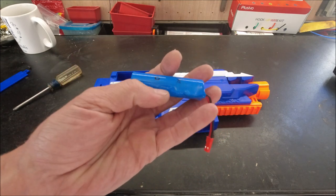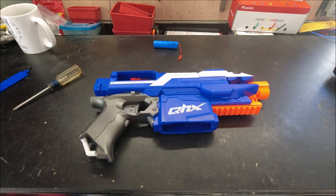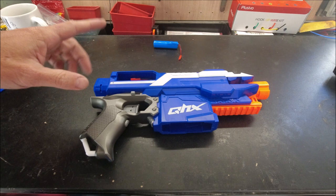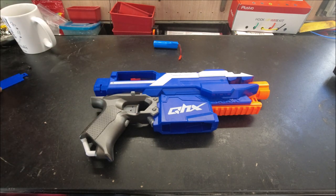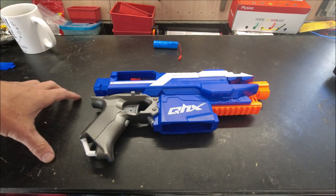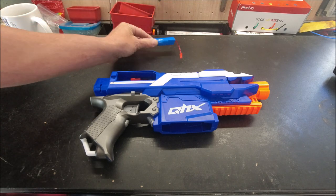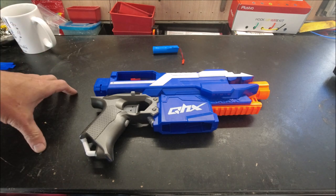So it's the equivalent of a 1S. That's obviously going to be an issue trying to hook up a 2S LiPo, because the board in this thing - it was manufactured in China, probably as cheap as you can get - and I'm sure will not handle the voltage from a 2S LiPo. Fully charged, this is going to be about 4.2V, equivalent of 1S, and a fully charged 2S makes it right around 8.4V at peak charge.